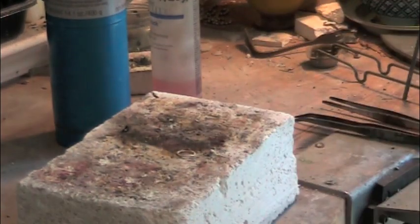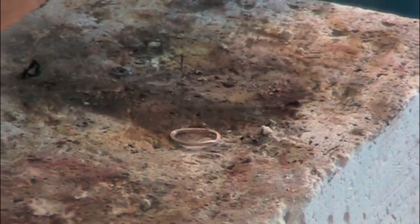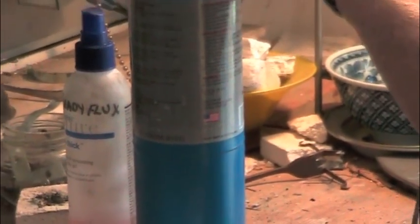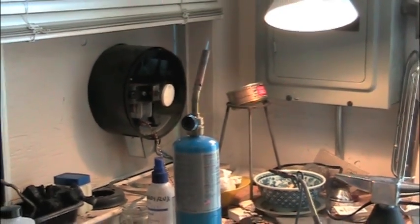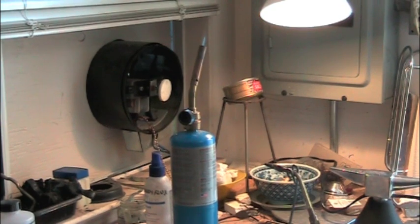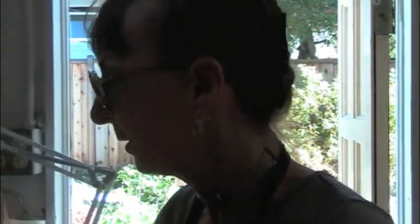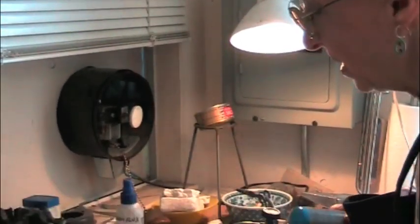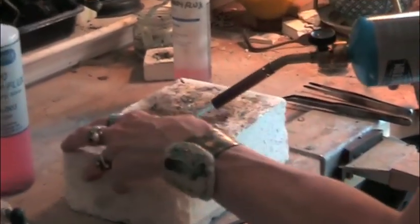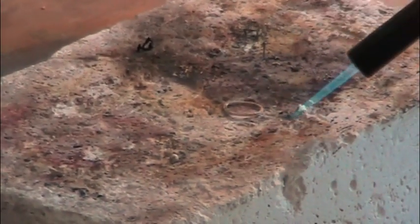I spray a little bit of my flux in the lid, grab a brush, grab some of my eutectic solder, paint it on — and I want it very liberal because the stuff is so fine that you need quite a bit on there. Then I'm going to light my torch and let that set a minute. I'm going to change into protective glasses — these are didymium lenses. I've attached the didymium to an older pair of glasses so that the sodium flare won't hurt my eyes. I'm taking my torch and heating the whole thing outside of the little ring.